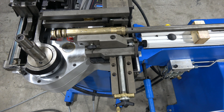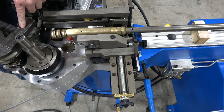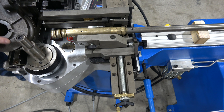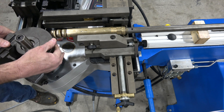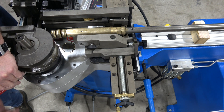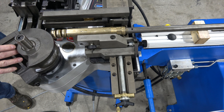Next, mount the former. This former has a radius — in this case R76 for one and a half inch tube — and it mounts on the spindle. On the bottom of the former you'll see a detent that goes into the former return spring recess. It may not sit down properly at first, so use a bar to pop it over and seat it down on the head. Once seated, the former return spring will bring the former back.